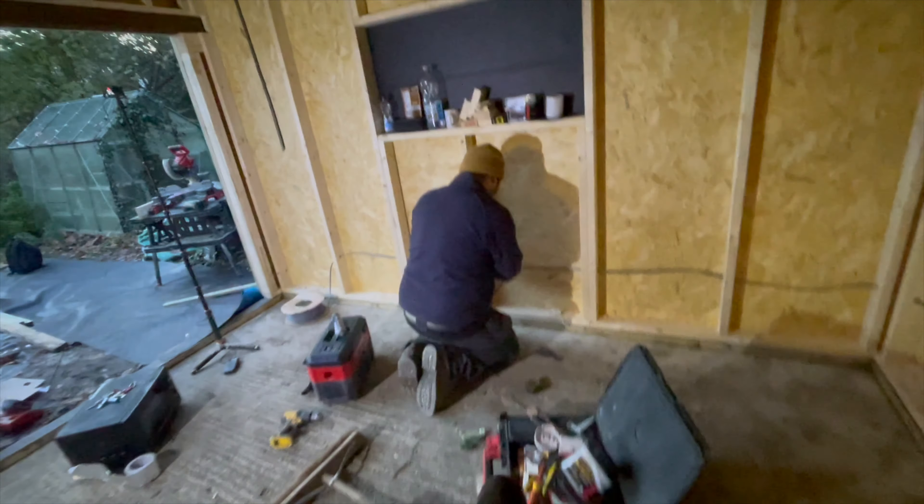Today we're going to put some more rockwool against the wall and then get the inner shell in. This will be super soundproofed — three layers of insulation, decoupled from the main structure, with a studio window with multiple layers of glass. Yesterday we got all the insulation done and all the electrics in — ring main going around each room, lighting circuits, it's all taking shape.